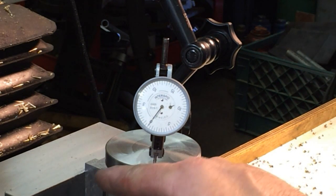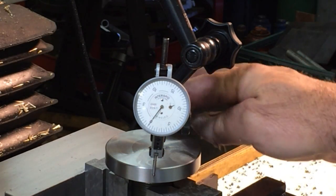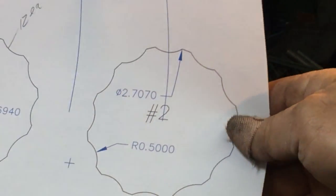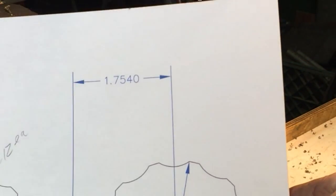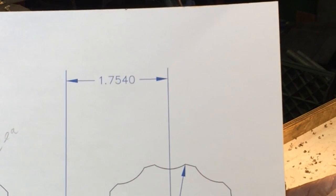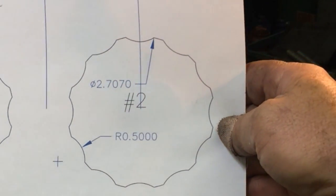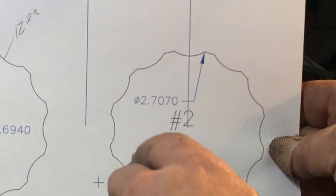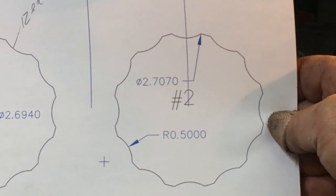What we're going to do is use a one-inch end mill. I calculated the bolt circle — the one-inch end mill needs to go around here to scallop the edges. The radius for the bolt circle is 1.754 inches. We're going to do 12 scallops. This is one of the advantages of using a CAD drawing to figure this stuff out — makes it nice and easy. I'm going to go in about 100 thousandths of an inch; the scallop depth should come out pretty nice.